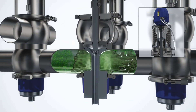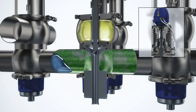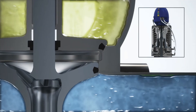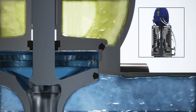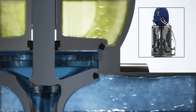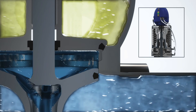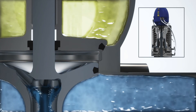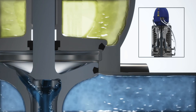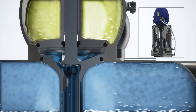The design of unique mix-proof valves enables different products to flow through each section of the valve bodies without any risk of cross-contamination. Like the seat lift operation, the fast-acting seat push function is controlled by a defined metal-to-metal opening, which provides a throttling edge. This speeds up the cleaning process by creating high turbulence and scrubbing effects, making very efficient use of minimal CIP fluid, while reducing CIP fluid pressure and promoting risk-free cleaning with no risk of pressure build-up in the leakage chamber.